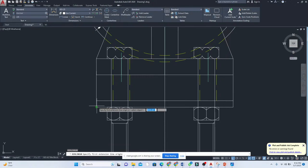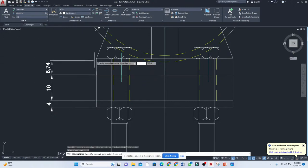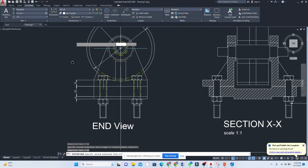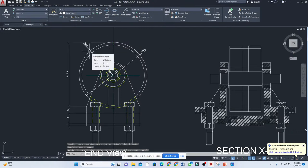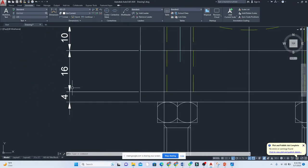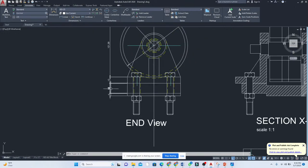And remember, you're going to make your dimensions neat, because there are ways to do this. You want to ensure that everything is aligned. It shouldn't be in and out and in and out. You want to present your drawing neatly. So for example, here where you're seeing these numbers, the numbers are not overpowering. Your dimension should not be as large as your drawing. This is good enough.